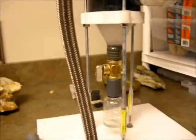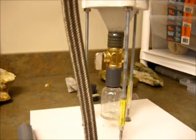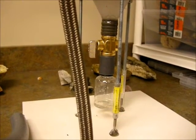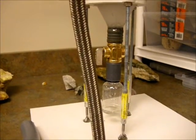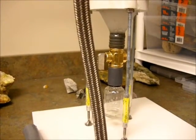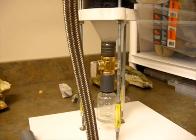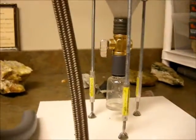I had to completely redesign the capture chamber down here with a bigger valve and a bigger vial. Air was getting caught as the valve opened and wouldn't pass through to let the water down with the small quarter-inch valve. So I've got a three-quarter inch valve in here, and now when you open it the vial fills up with water. Because the air wasn't getting out, the sands weren't going down into the smaller vial. Bigger vial, working nicer.